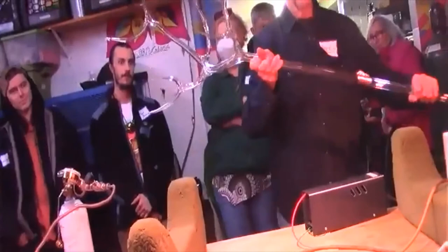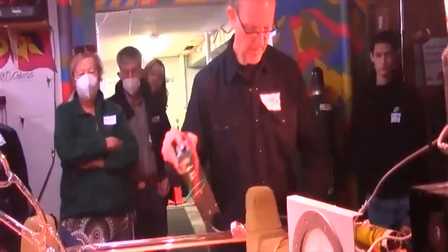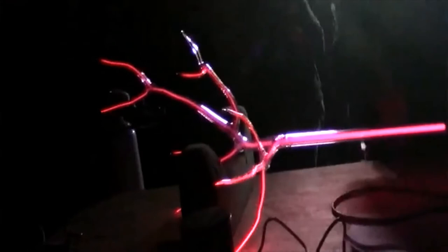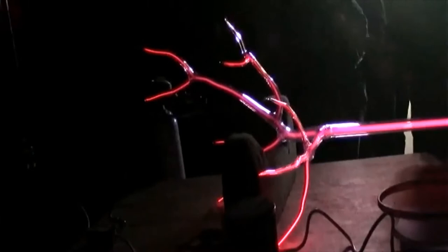Now let's turn the lights off and you can see what a thoroughly contaminated tube looks like. You can see there's neon in there, but this purple-magenta color is a mixture of neon and probably a lot of water vapor and some components of air - oxygen, nitrogen, carbon dioxide. They stick to the inside wall, and water is really pernicious - it not only adsorbs on the surface but absorbs into the bulk. Note how lavender it is right here.